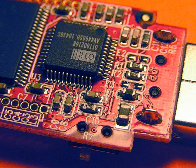As with capacitors, component values and identifiers for smaller inductors are not usually marked on the component itself, if not documented or printed on the PCB. Measurement, usually removed from the circuit, is the only way of determining them. Larger inductors, especially wire-wound types in larger footprints, usually have the value printed on the top. For example, 330, which equates to a value of 33 microhenry.